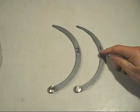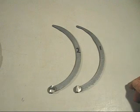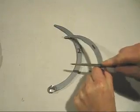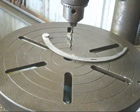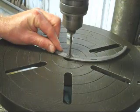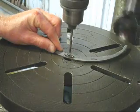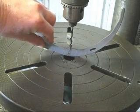Because this test is such a small surface area it will cool down really fast, and we'll see if the ferrosilicon made it soft enough to machine. The first test I'll do is with the file — it does file but it feels very hard. The second test is to see if I can drill the hole through this test piece. It did drill through there but I noticed it was a lot harder than normal.